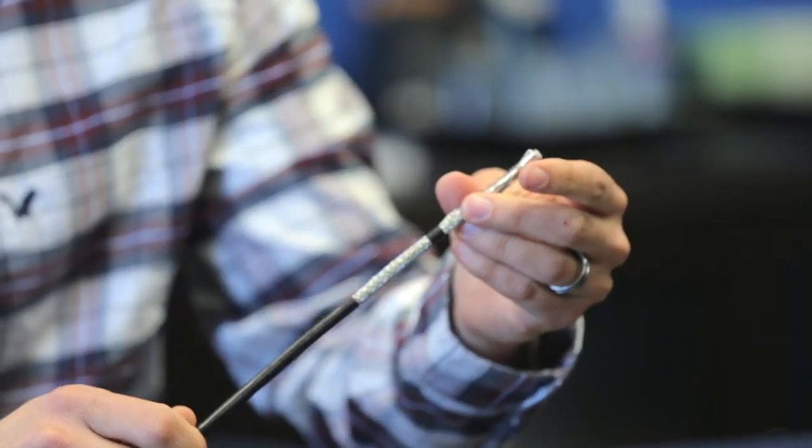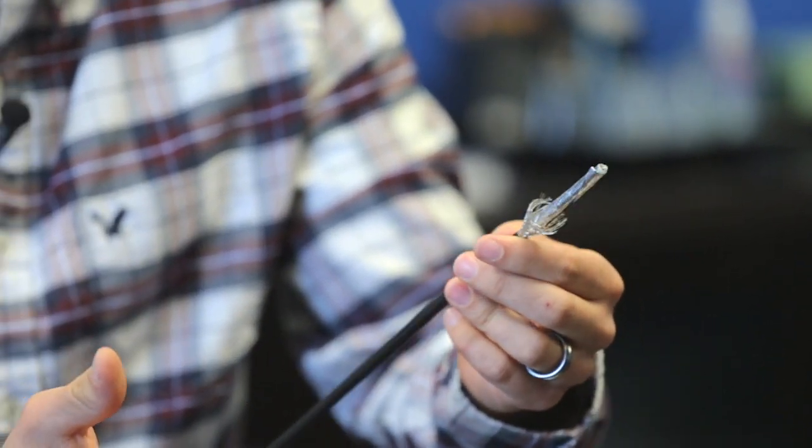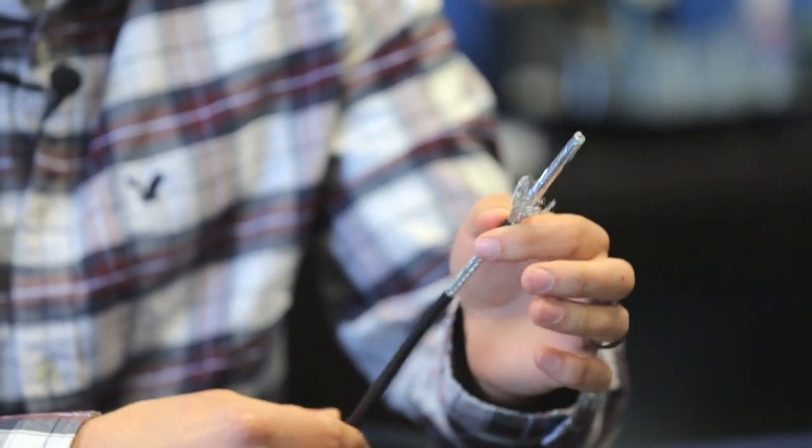In a perfect world, when you're connectorizing a cable and putting the connector on, you're going to want to terminate that shield as effectively as possible on both ends of the cable. If there are multiple twisted pairs that each have their own shield, it's most effective if each shield is terminated itself and they're not allowed to touch each other electrically.